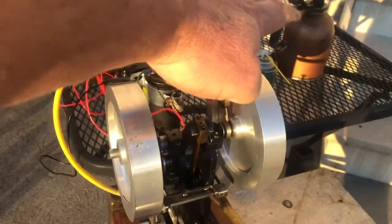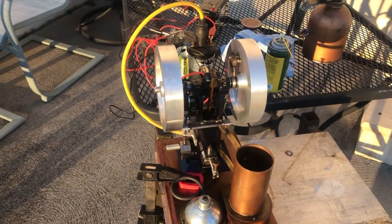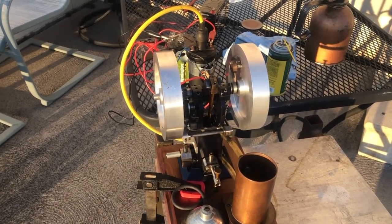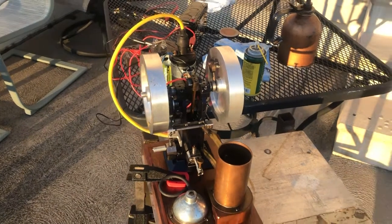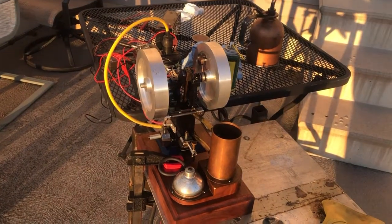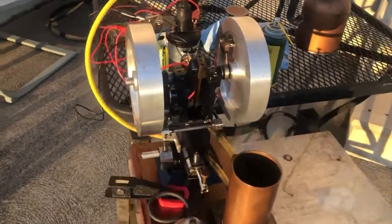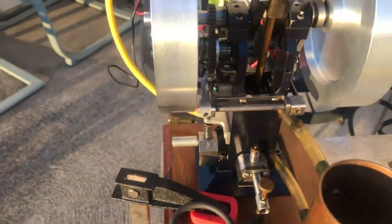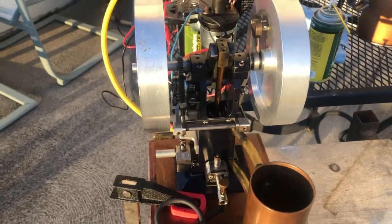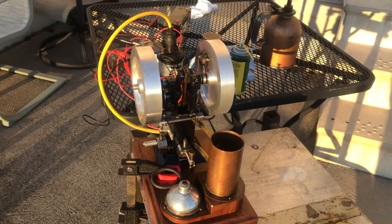Except for the flywheels — I believe he designed it with one flywheel, which would be the governor flywheel here. I've run it with both flywheels and with one flywheel. The single aluminum flywheel doesn't really have enough mass to make it run nice — it does run pretty good, but definitely runs better with both. It's kind of nice with just the one flywheel because then the cam, timing, ignition points, and all that are visible.